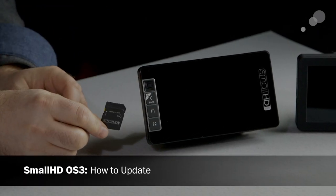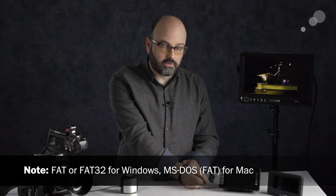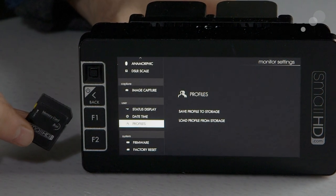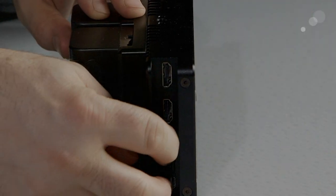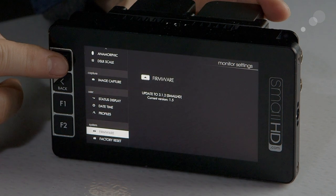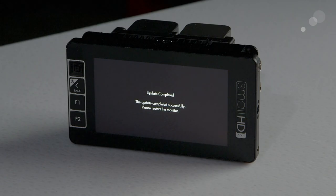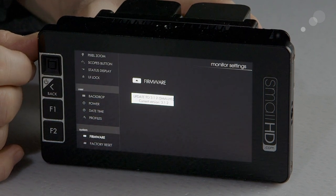How do you do the update? It's pretty easy. You need to have an SD card formatted correctly and it does have to be 16 gigabytes or less in physical size. Once the card is formatted, put that firmware bin file on there, insert it into your monitor, go to the firmware page and update. Have your monitor plugged into mains or with a freshly charged battery. Once done, verify that it is version 3.1.2, and you will have this additional functionality on your monitors.